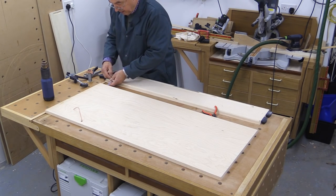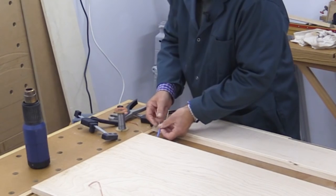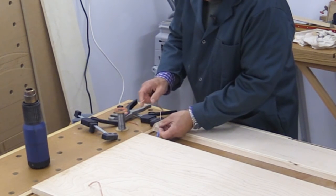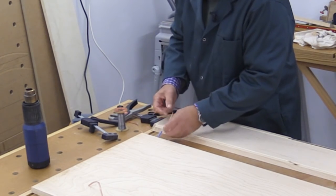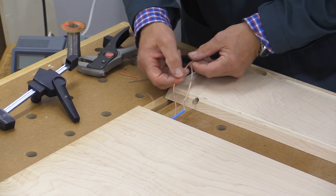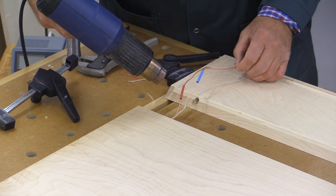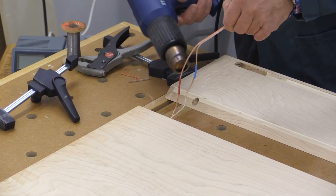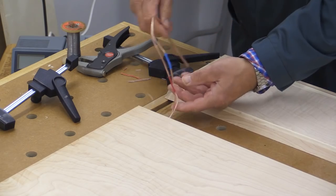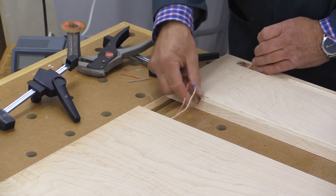The way I'm going to do this is very simple. I'm going to solder two pieces of wire together and then cover it in shrink wrap. Notice I've staggered the joints so that if there was any risk of anything coming through the insulation of the shrink wrap, they would not be anywhere near each other. That join will be buried in here. Right, that's those done. Now I'm just going to move the shrink wrap down into position. Now when I'm ready I can shove this wire through here and that pair of joints will be hidden in there.